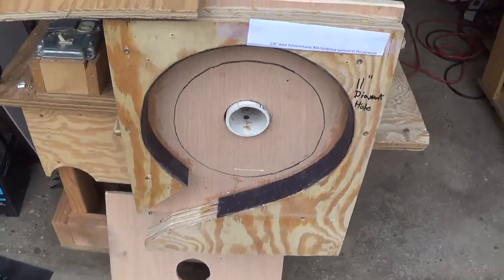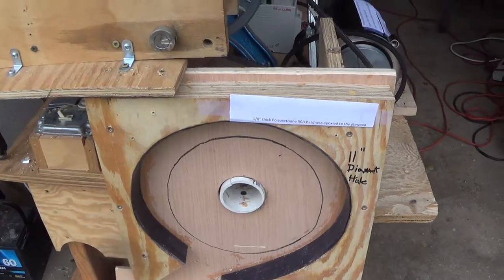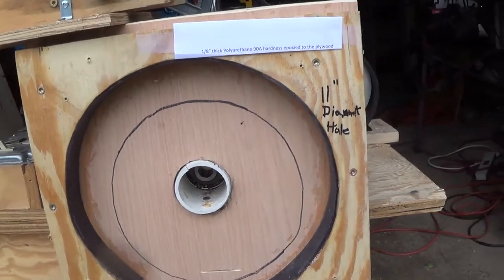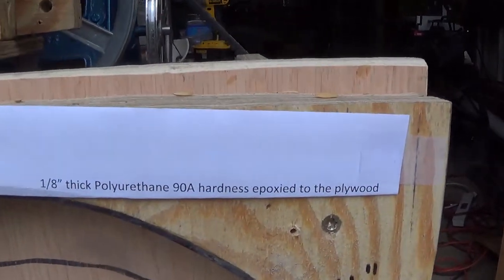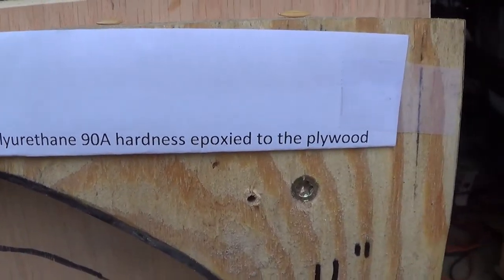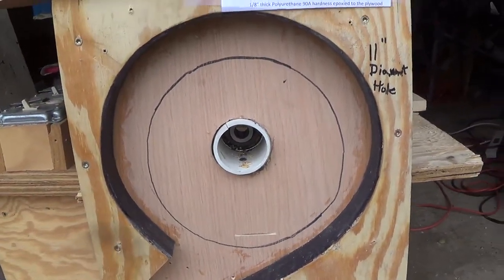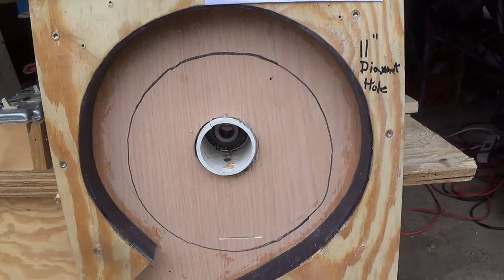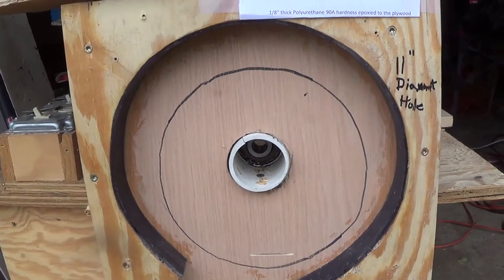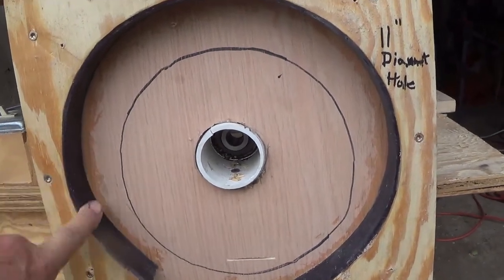So that's how simple this is. You have an impeller. You rotate it at around 3,500 RPM. You have the impact ring made out of polyurethane — in this case it was an eighth of an inch thick. We don't know how long this will last, but the one that Thomas International sells, it appears it will do thousands of pounds. So imagine you put this on — do this diameter — then if this wears you epoxy on another layer here.